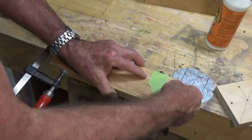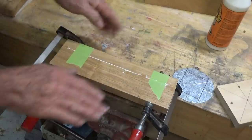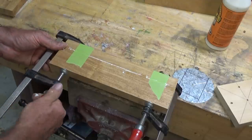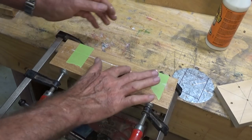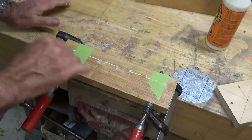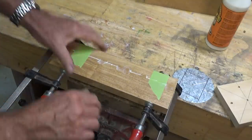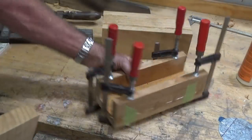While you've got a glue film in that joint there, these surfaces will want to skid around, and you just got to adjust your clamps and slowly tighten everything up and just feel that that's level. And don't over tighten it either. If you squeeze all the glue out, you've got nothing there to form the bond. So just moderate pressure is all you need.